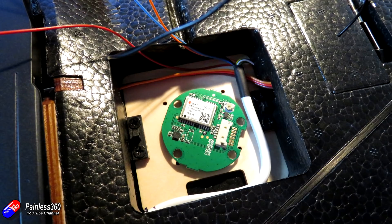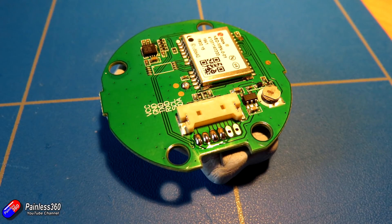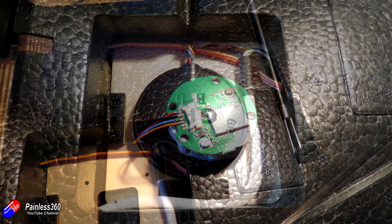Once all the connections are made for the GPS and receiver on the other side, I split the cables: one set of four going into the receiver bay for power, ground, SBUS, and smart port telemetry; the other four for ground, 5V, and the transmit and receive lines. I soldered blobs of solder onto the pads on the back of the GPS and soldered the wires into place. One downside of the wire I'm using is that it has plastic insulation that melts if you hold the iron too long — next time I'd source a cable with silicone insulation. After double-checking that transmit on the GPS goes to receive on the flight controller UART, I snapped the top on and added a bit of double-sided foam tape in the bay.